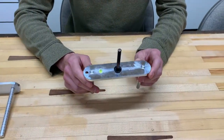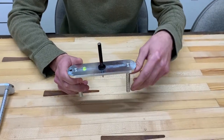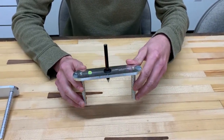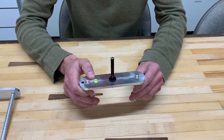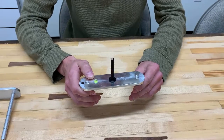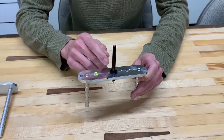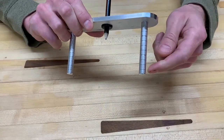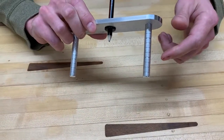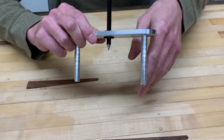The features on the center finders include your tool body, the two pegs for helping center, the bubble level which makes sure that you're holding your tool level as you're making your center lines, a hanging hole, a rubber grommet to hold your golf pencil, and then on the pegs we have quarter inch increments which can be used as a depth gauge to find out how far down your mortise holes are.